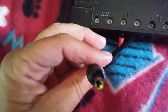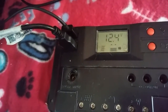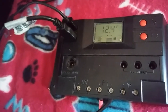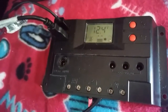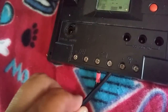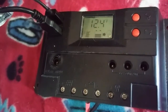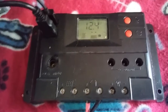I tried to clean it off — I did get it cleaned off — but this connector is just too shot. You need that plastic around it for insulation. It was charging up to about 13.8V. It's been really sunny these last few days camping, so the batteries were pretty much full. This cheap charge controller is completely shot, so I'm going to have to get a new one.